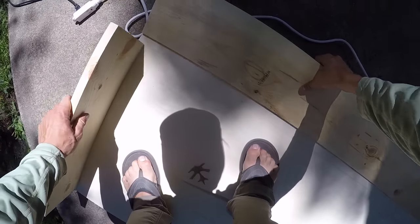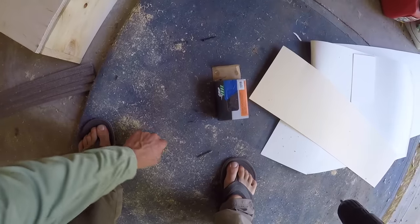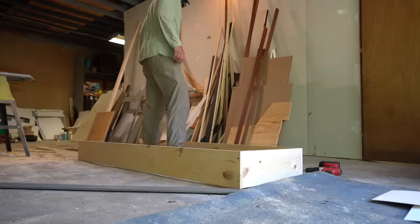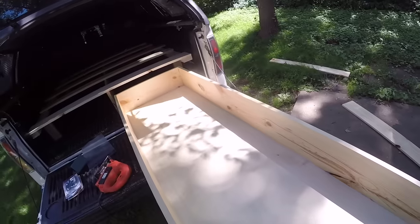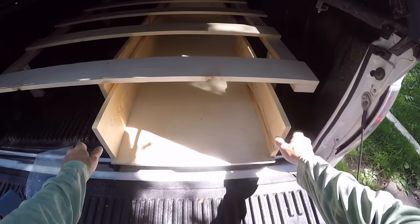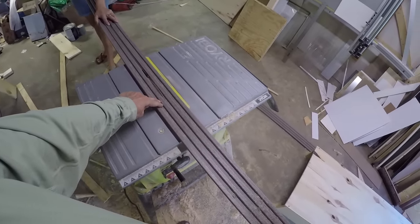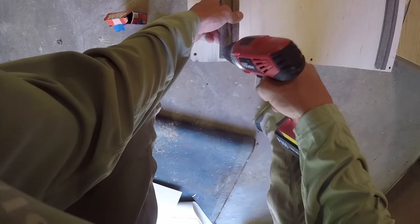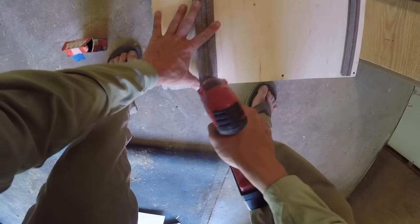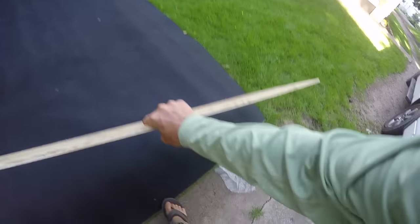First things first was to get things framed out. I ended up screwing together two pieces of 1x8 and then screwing together the next two pieces of 1x8 to form a square. I left the faces off the drawer to make it easier on myself at the end — I thought it would be easier to line up the face of the drawer at the end rather than put it on blindly. After the drawers were assembled, I checked for fitting, made sure it fit right, and then I made the tracks. I cut my composite wood right in half, put that plastic piece on, measured it out, and made sure it rode on my track just fine. It rode very smooth — it pulls out really nice even on full weight, and actually the drawers support my whole weight.